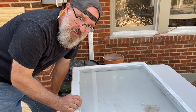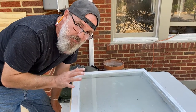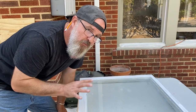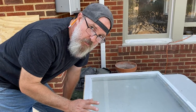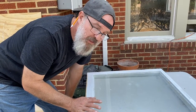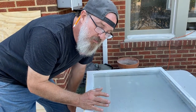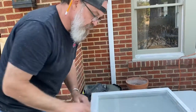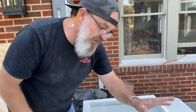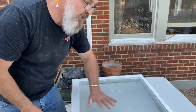You could take it or leave it in different circumstances, but this is one of those situations that explains the real need for bedding in old window work. In a brand new sash the glass is perfectly flat, so there are arguments that would let you not do it. But as a general rule it provides a nice seat and a nice support for that bow.